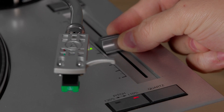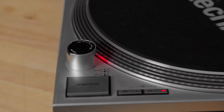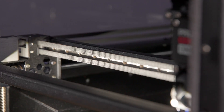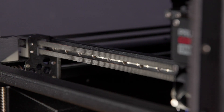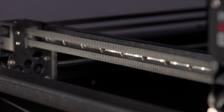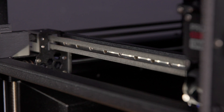They're going a bit too fast, so what we do is we adjust the slider — it goes just a little bit slower and now, as you can see, it's almost static. This is pretty much what's going to be happening with the Core 1 and the new belt tuning wizard. Before we start the whole process of how to tune the belts, I want to show you exactly what is happening in comparison to the turntable. As you can see, there is a slight movement in the upper belt. What is happening is that the extruder is exciting the belt at a certain frequency, which currently is 95.5 Hz. The reason you're seeing these weird lines through the lens is because the LED lights inside the printer are flashing extremely rapidly at a certain frequency to produce a stroboscopic effect — the same thing as on the turntable.